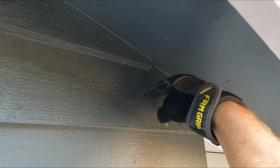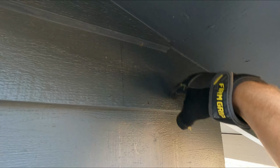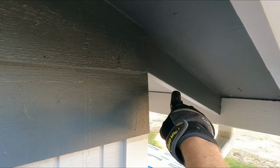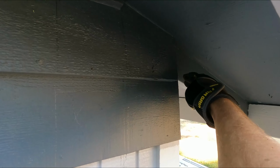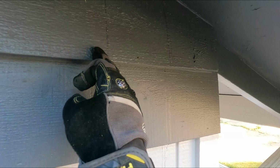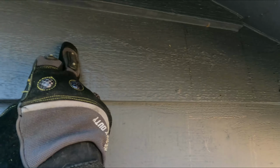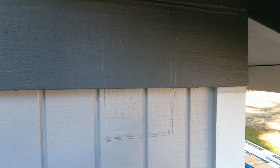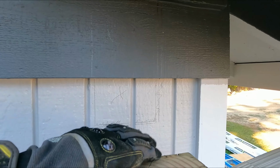This also gives us our initial measurements for the rafters and how the rafters are going to come in. They are going to tail off into a 2x4 here, and then they'll have a bird's mouth. They are 2x10s, so the bird's mouth will come down and then follow up as we go up there. That will be to come, but I just wanted to show you how to work backwards.